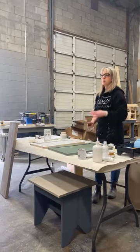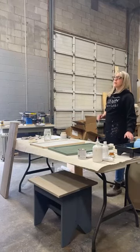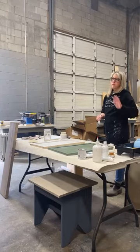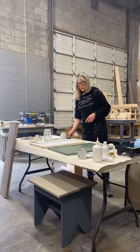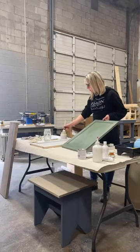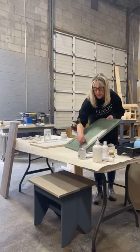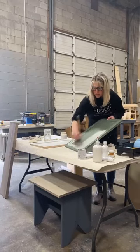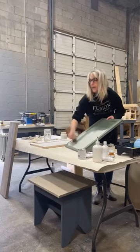That's normal with basic cabinetry refinishing. When working on laminate, it's the same thing — TSP, sand to get that grit, then add ultra grip before you paint. That first coat is not going to look great; you're going to see the undercoat and think they're brush strokes, but you're just seeing the thinness of the paint with the color underneath.